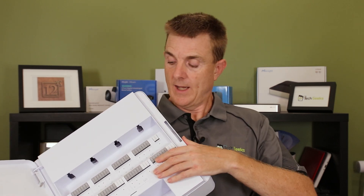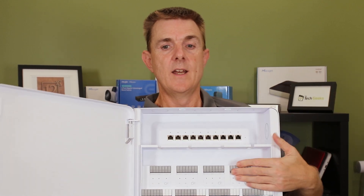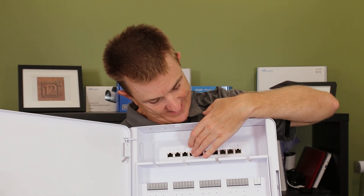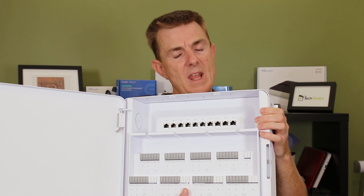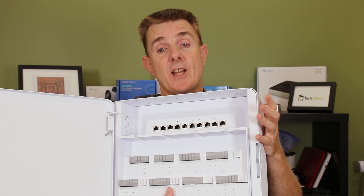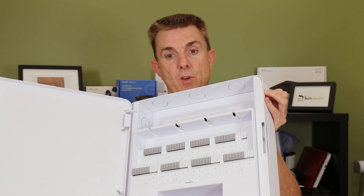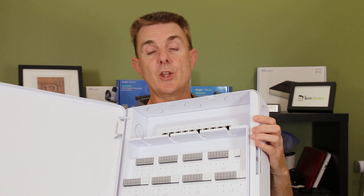Up on the top here we have — hopefully I can take this off and show you — this is where all of your ethernet cable connections are, because these go out to your readers, whether inside or outside the door. There are 10 ethernet connectors along there. So that gives you 10 options for readers, exit, and potentially cameras as well. PoE will come out from here too. You can use the holes in the top or the sides to bring cables in and out, bring all your terminals in underneath, or down through these slots into the UA hubs.